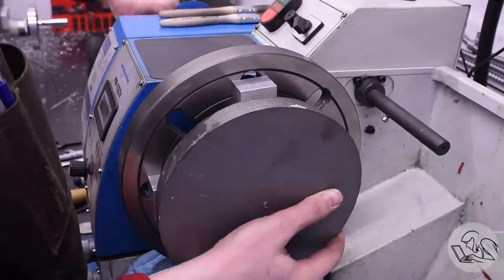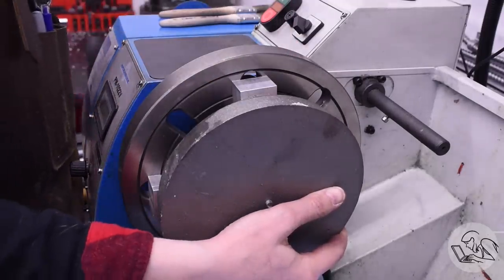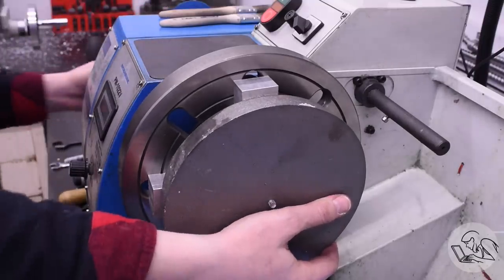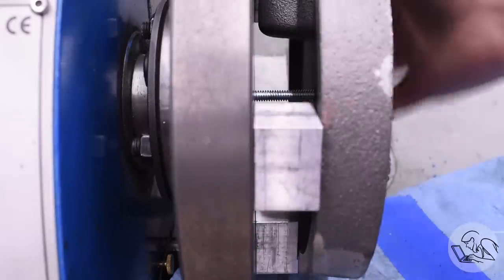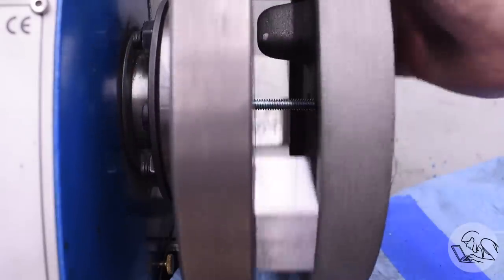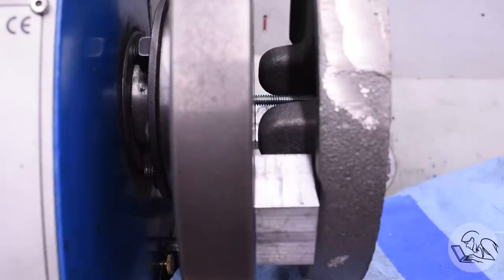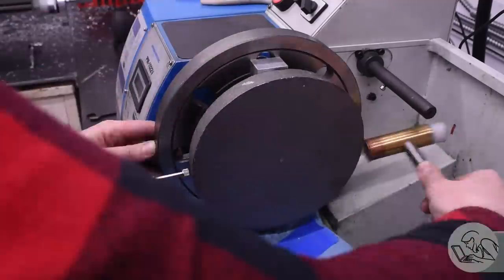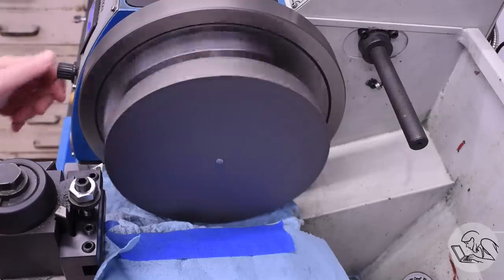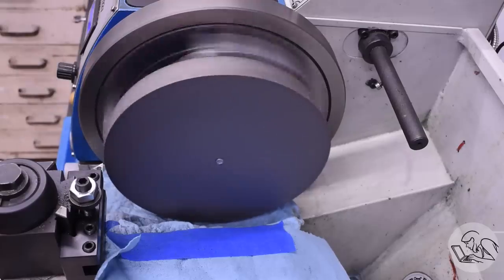Now you can see how this works: I put the drawbar through the center again, the plate is clamped up against those blocks, and the blocks provide spacing for the cast bosses underneath the part against the faceplate. Honestly this is probably overkill — you could probably use blocks of wood and it would be fine. Parallelism front to back of this table isn't all that critical, but it didn't take that long to do it properly. With that dialed in, away we go.